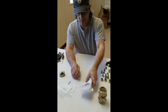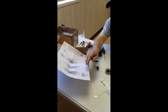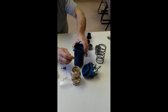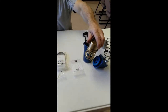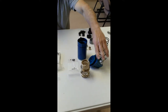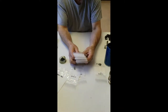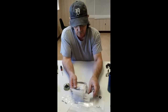First thing I'm going to do is a sub-assembly. The print shows me that a 2-130 o-ring goes right inside the sleeve. This here is a cylinder, marked on the print as detail 11M 1-240. This also has a detail number — it's an 11M 598 sleeve. And the manifold has a detail number: 11M 1-238. They're all marked off right here. A lot of times you get a bag of seals and you just have to match them up with the old ones.